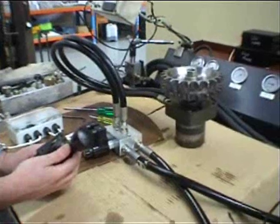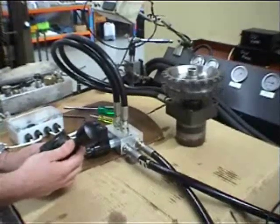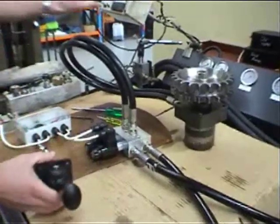The FMDB proportional valves can be driven by both 12 and 24 volt systems. We stock a large range of amplifiers to cover most of the commonly used input signals, from 4 to 20 milliamps to 10k pots to joysticks.